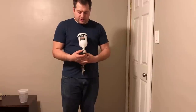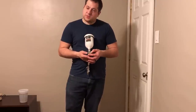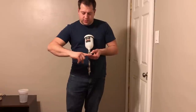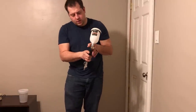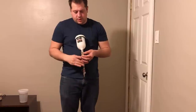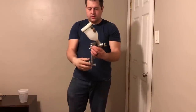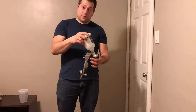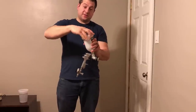Another part of the gun is the tip. You can loosen it and turn it in one of two directions. The spray pattern is perpendicular to the tip axis — in one orientation it sprays out wide up and down, which works great if you're spraying back and forth. But if you have a vertical panel and need to spray up and down, you switch the tip so the pattern goes out horizontally instead.